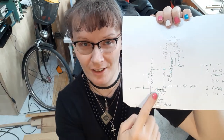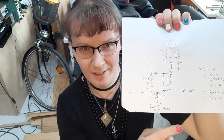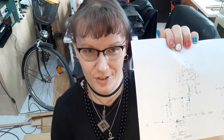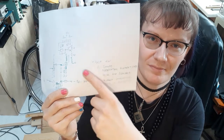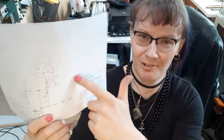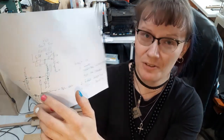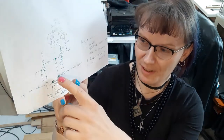While it wouldn't be as effective for small tubes like the EL84, it might be pretty useful if you use a 6S33S. Of course, now with the war in Ukraine and the lockdown on the Russian economy, getting those tubes could be quite problematic. For the control element I was thinking about a MOSFET transistor, an analog switch, or a relay — and I need to consider how adding the side chain here would also affect the audio signal.